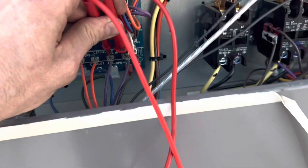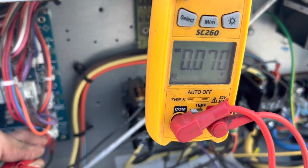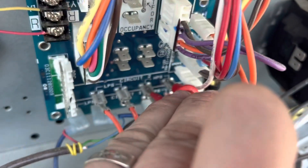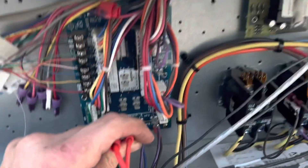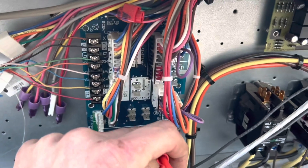I know this is the case but I want to show you. Second stage — high pressure across that we have zero, which means it's closed, which means it's allowing the system to run. Listen for the click — bang — it's shut off, and now reads 25 because you've got 25 to ground there. The high pressure is now open, so second stage is shutting off on high pressure.